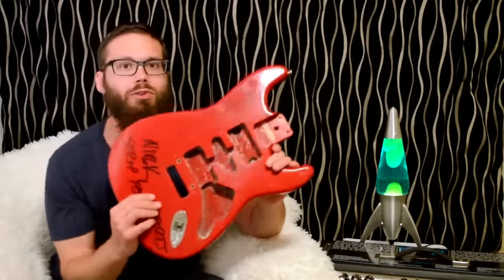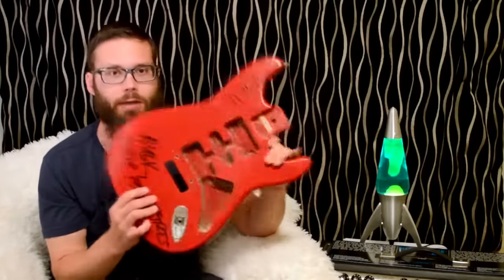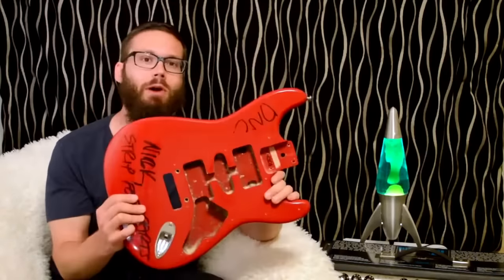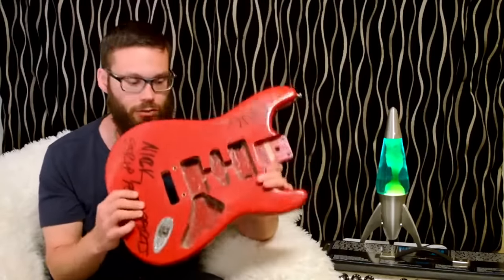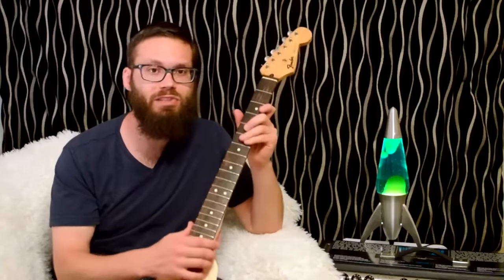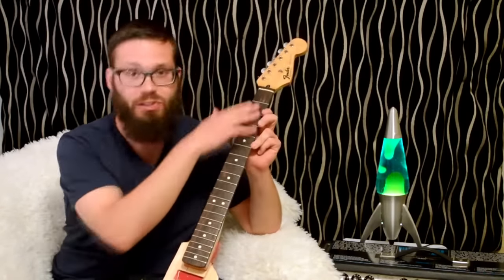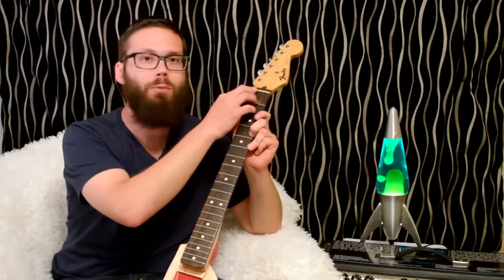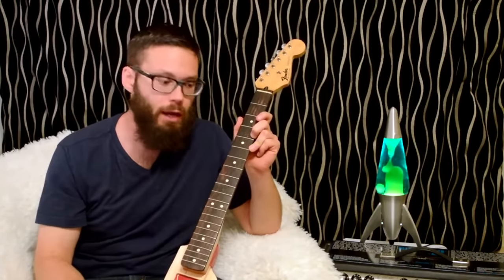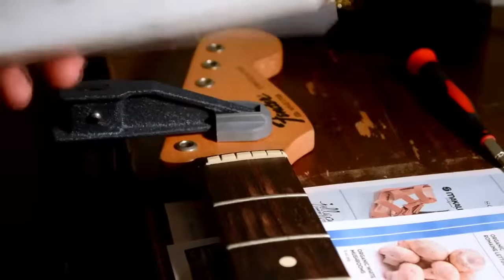And it just so happens that when I worked as a guitar tech in a music store, I got to keep this Cort Strat copy body. We stripped all the parts off of it, and I took the body home. This is almost the exact same color and routing as that original Strat, so it'll make a great donor for the neck. So now that I know that the neck is stable, it's not twisted, the truss rod works, I'm going to go ahead and do a stainless steel refret, carve a new bone nut, and install new tuners on here, and hopefully get a brand new guitar. This is going to be my dumpster Strat.